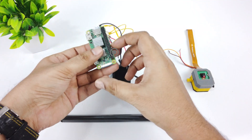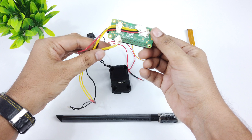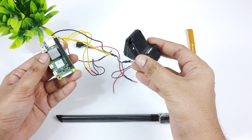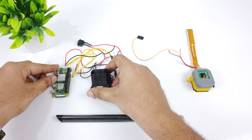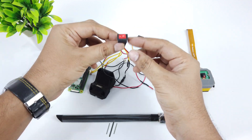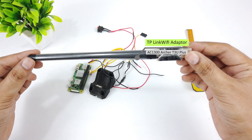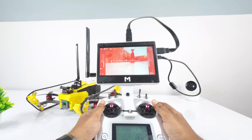I will be using this Raspberry Pi Zero 2W as a processor for my OpenHD communication system. I have directly soldered the USB port wires to connect the external antenna, and I have also provided a switch for powering it. All the wiring diagrams can be found in the link in the description. This is the TP-Link AC1300 WiFi adapter — I will be using two of them, one for the drone and one for the ground station.